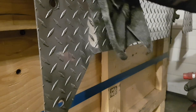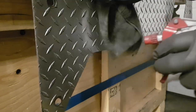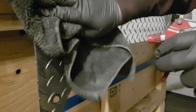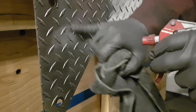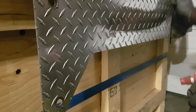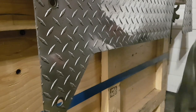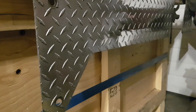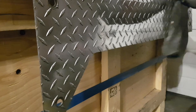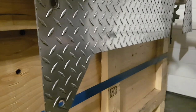So once we have it all cut, what we do is we go ahead and wipe it down. The reason behind this is because your rouge will get caught in the metal in general, on the edges of this diamond and this way. And when we go to the next step, we just want to be using one rouge at a time. So if we have leftover rouge on there, in theory, we're polishing both. So this isn't always necessary.